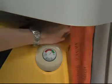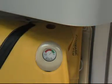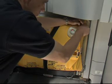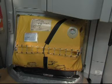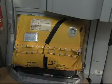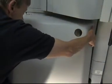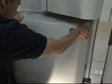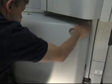Remove the safety pin from the pack assembly and stow it in the pocket on the slide assembly. Position the decorative cover with the upper end on the upper end of the slide pack board. Align the spring-loaded latches to match with the brackets on the slide and close them. Push the lower edge of the decorative cover against the pack assembly until the spring clips engage.